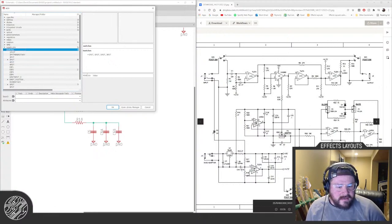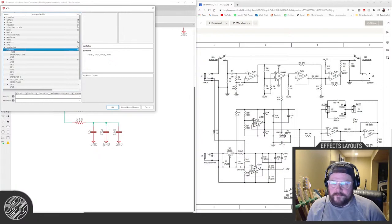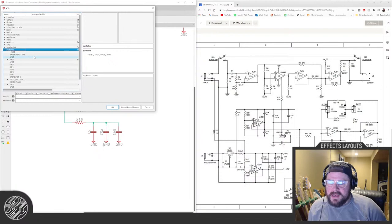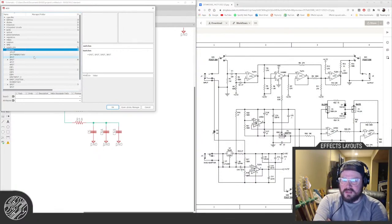Yeah, we mentioned that a little while ago, Chris. The pot taper changes. You were talking mostly about the rate pot, right? The speed. That's something we'll have to play around with when we get into the prototype stage. Slope, I feel like, is fine with a linear. This is just going between the diodes and resistors here. That's probably fine. Depth is probably a matter of taste between logarithmic or linear. Rate and depth. Okay, so that might be another. Yeah, we'll play around with it for sure. Or you will, if you're the one verifying this, Chris. Yeah, if a pot value or taper doesn't fix the rate one, it's only a 1K. Maybe even 2K might be better.